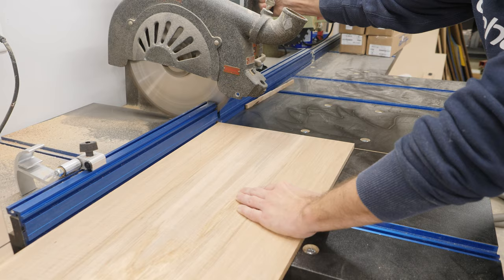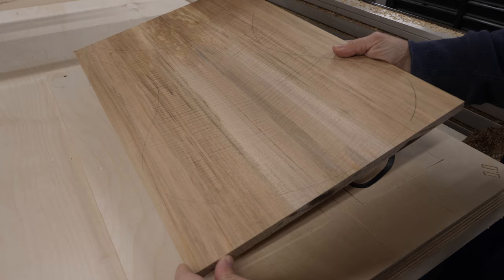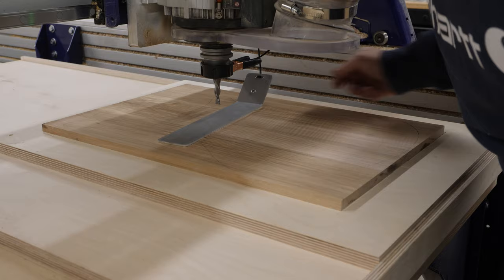If you've been following along with this series, you know I've been using my ShopBot CNC a fair bit for the machining operations on this guitar build. Here is another jig I made for the vacuum table, and I have a witness mark on there so that way I can center my piece on this fixture. The first operation I'm going to do on the CNC for this portion of the build is a relief carve on the perimeter of this guitar top.